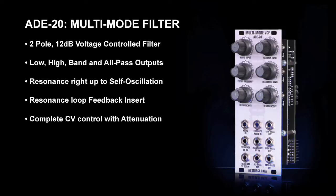The ADE20 has a complete control voltage spec allowing manual, on-board and external control over the frequency cutoff and resonance level. There are manual gain and attenuation controls for both the audio and feedback inputs, and there is a dedicated input for the frequency cutoff that scales external CV signals to the one volt per octave standard.